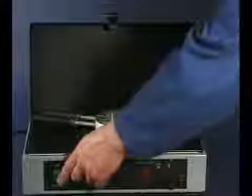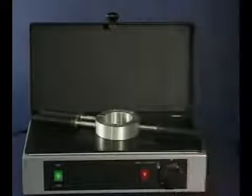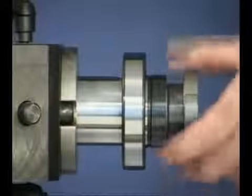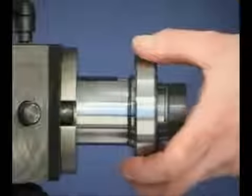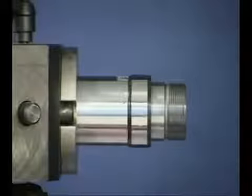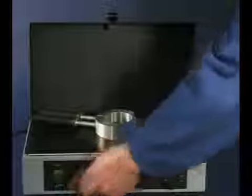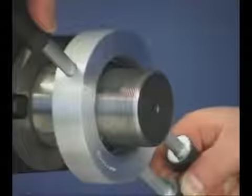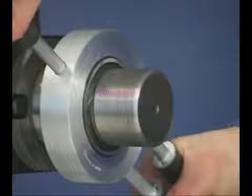By heating a special aluminium clamping ring using an SKF hot plate, damage-free removal of the tight-fitted inner ring can be achieved. The transfer of the heat from the aluminium ring expands the bearing inner ring, so ensuring a simple removal without damaging the shaft. On very large inner rings, an SKF special induction heater can be used for both mounting and dismounting.